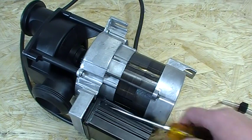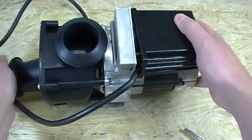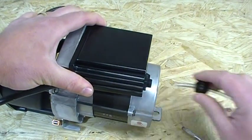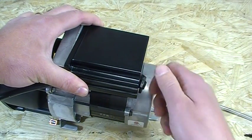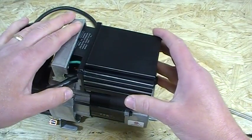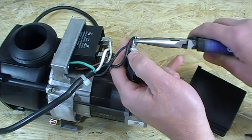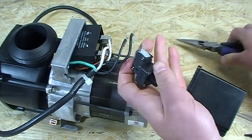You can see how easy it is once you've got it in a good working environment right in front of you. Two screws are off the control box. Once you've got the ferrule off the back of the air switch, there's another mounting lock nut which you can loosen with your fingers — if it's still tight, get a pair of pliers on that. Take that lock nut off and the cover comes right off. There's our air switch. The hot wire comes right in there and interrupts it just like any other switch on a wall in your house. I'm going to use a pair of needle nose pliers and just gently pull off the terminals of the old air switch.